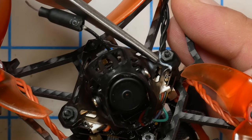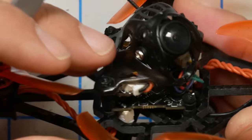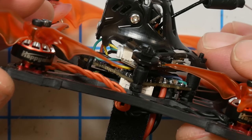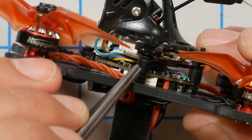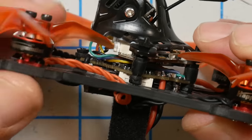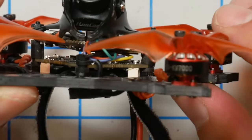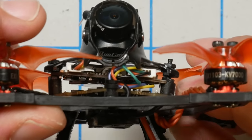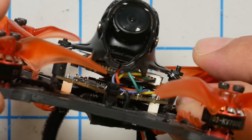That's what we do with these quads and they need to be able to take it. After just one relatively solid crash, this canopy is basically toast — it's got a break here and it broke down here. The other thing that is really too bad is that this whole stack is held together by a set of M2 screws. Although the screws are metal and relatively stiff, all of the boards are soft-mounted, and that means there's so much flex — look at all that flex. After the same head-on impact that broke the canopy, you can see that the video transmitter has popped out of its soft mounting and everything is just sort of a mess.